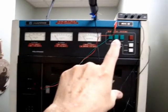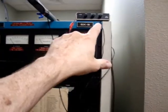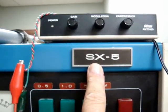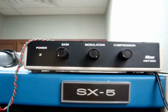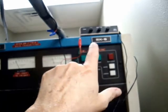This is the Harris SX-5 transmitter we recently got, and it's being driven with an SS-Tran into the oscillator. This is a temporary installation. We had to come up with a way to change it over to our frequency, so we used an SS-Tran AMT-3000, set it at the frequency that we're on, and then connected it to the Harris SX-5 to bypass the Harris SX-5 internal oscillator.